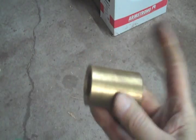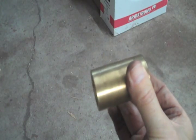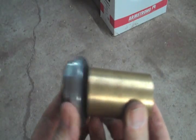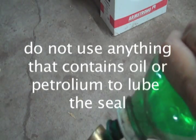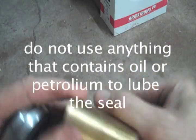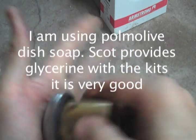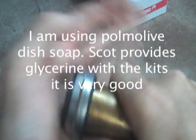Now we have the sleeve. We want to put the rotating head on the sleeve before we put it into the pump. You have the beveled edge that goes down, the flat side that goes up against the impeller, and the rotating head of the seal. The rotating head goes in this direction — flat side of the sleeve up, beveled side down. You've got the carbon element facing down toward the beveled side. Now you need to lubricate this just a little bit. They do supply some glycerin lubrication in the seal kit. Put the rotating head on a little ways, place it between your hands, and work it through there, pulling it down on the sleeve to a little farther than midway.